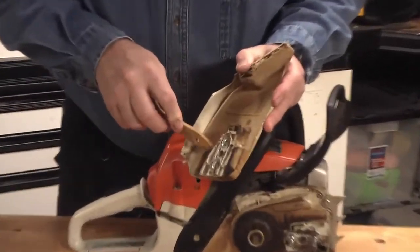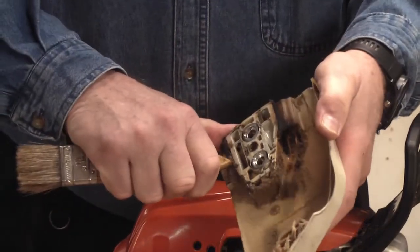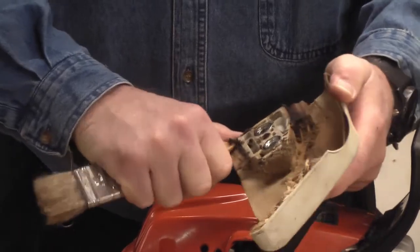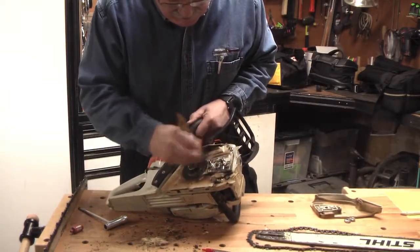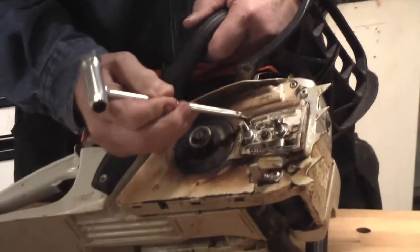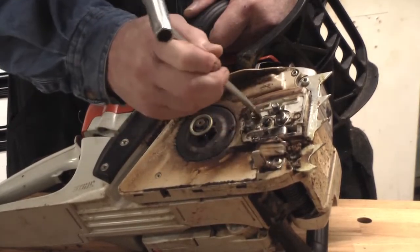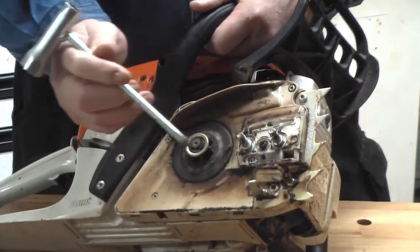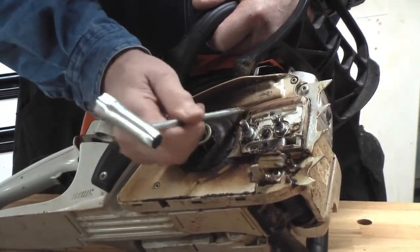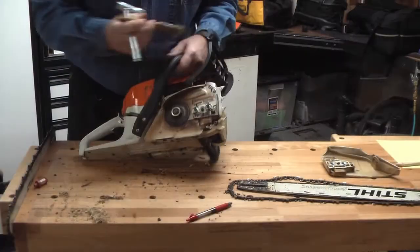This is what you really have to get clean, because a saw that's not being oiled is a saw that's not working very well. Release the bar, release the blade, and let's start with the housing. There's a large quantity of oil pouring through the blade on the oiler ports. This area right here is where the oil pools before it leads into the chainsaw blade itself, so this needs to be all neat and cleaned up.